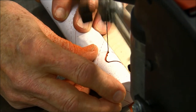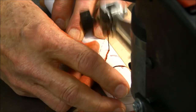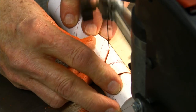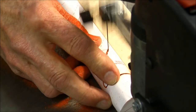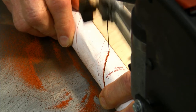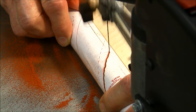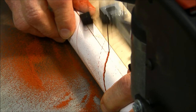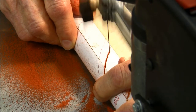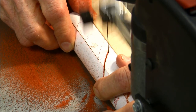To make the cut and stay on that line, you gently push it forward, and at the same time you're turning it to the light. This is the number five spiral blade. The article in the magazine said to use the number three, but being a novice at using a spiral blade, I wasn't getting enough opening, so I wanted something with a little more opening. That's why I'm using the number five.